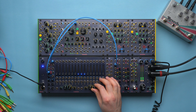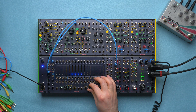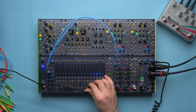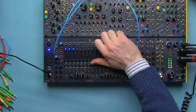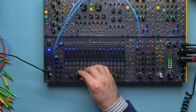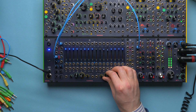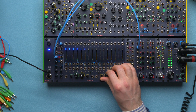If we set all the faders to the lower position, we can have our fake bandpass filter with variable gain, cutoff frequency, and Q. If we set all the faders to the upper position, we can take advantage of the negative side of the first knob and remove some bands, like a notch filter. This is why this knob is called peak notch.